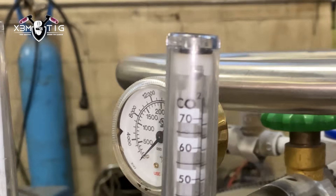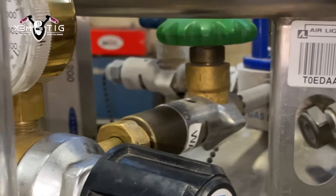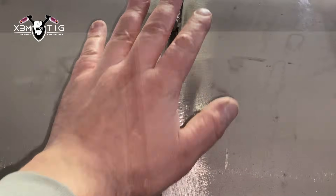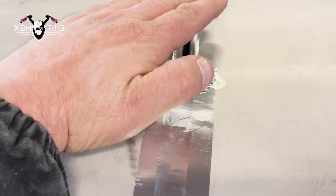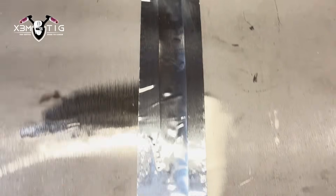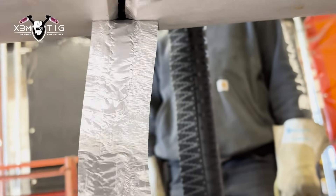For the purge, I'm using liquid argon. The flow meter is pretty much maxed out. I'm only using two hoses for the supply purge, and I got bridge tacks. I'm gonna put aluminum foil all the way around and leave the vent on the top. I usually go 15 to 20 minutes for purge time if you don't use any purge eye or oxygen monitor, so you can check your oxygen levels inside. Usually 15 minutes should be good enough.